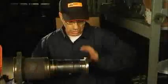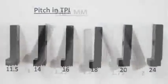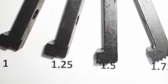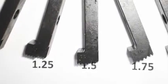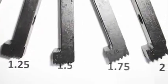Test the tool on the keyway. Make sure it's going smoothly above it and that the multi-teeth blade is touching the thread. When the skip adapter is ready to use, start rolling Nest 3 in the arrow direction until the thread is repaired. Multi-teeth blades are available in all needed pitches: 11 to 24 TPI and 1 to 2 millimeters. With a single pitch blade, you can fix any thread between a diameter of 1 and a quarter inch to 6 inches, or 35 millimeters to 152 millimeters. The pitch of the multi-teeth blade is clearly marked on the front of the blade.